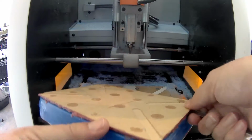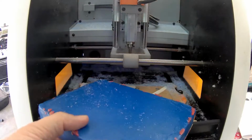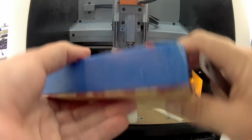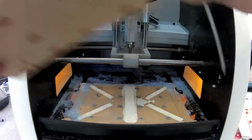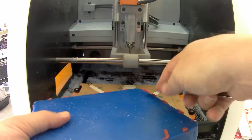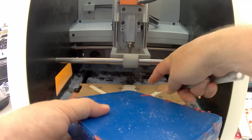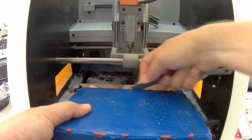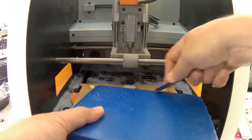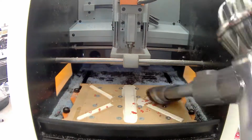The wax that I've used here is a soft wax, it's not a machinable wax, it's a different kind of wax entirely. You want to get rid of the red wax there because if you get that mixed in with your machinable wax and then remelt it, it's a contaminant and it will cause soft spots in the machinable wax. So whilst I'm scraping the weldings off this block, I want to vacuum them out of the machine. I might add a vacuum cleaner is a really nice thing to have around when you're doing this type of work.